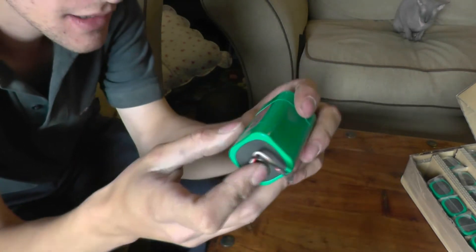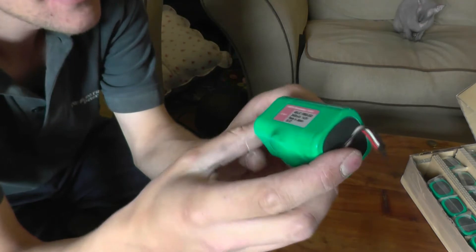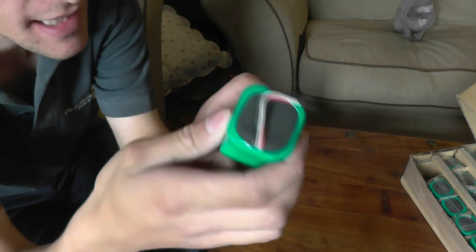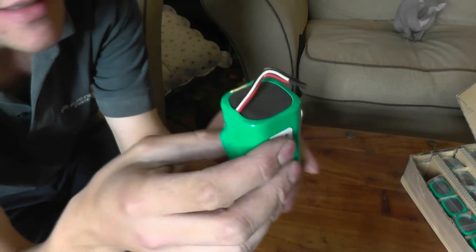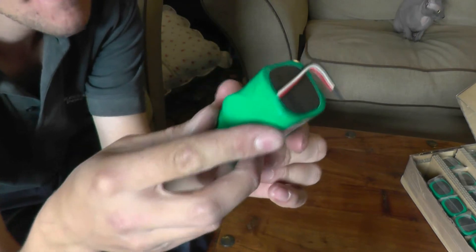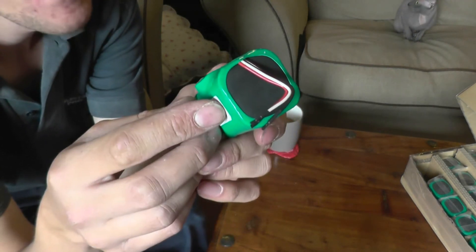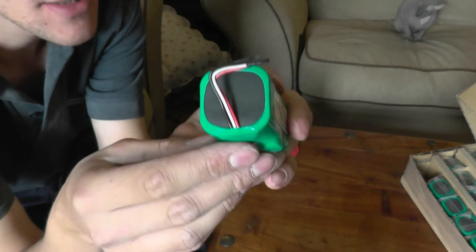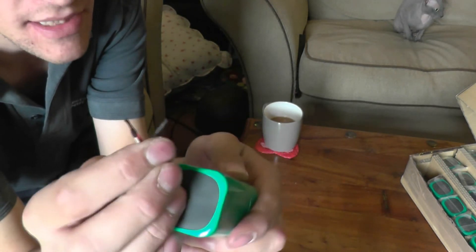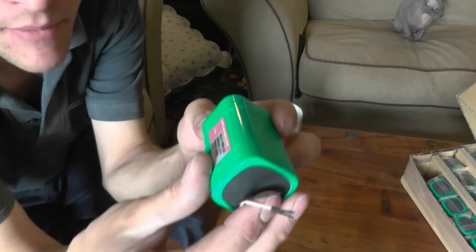You've certainly sent me quite a few. I've definitely got my work cut out with these — charging, discharging, finding out the capacity. I think what it might be best to do is to break them into individual cells and then charge, discharge and grade them all to see if they are holding their capacity.